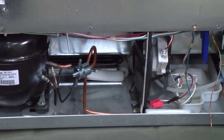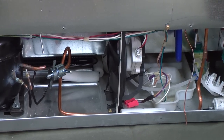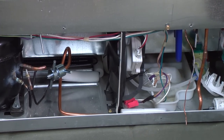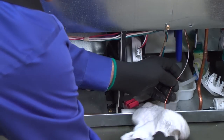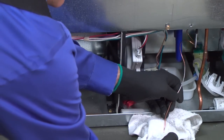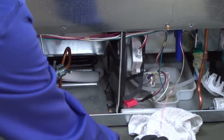The dryer has been removed and examined internally for contamination. Place the open cap tube end onto a shop towel. It is suggested to place the shop towel and cap tube end into a container to collect debris.